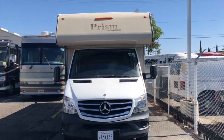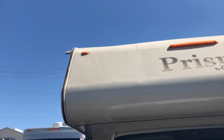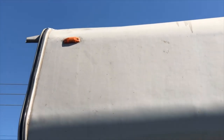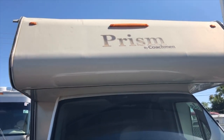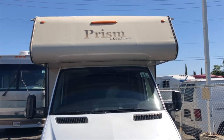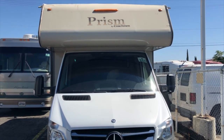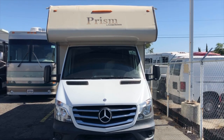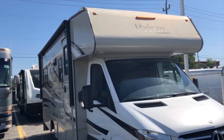Now let me show you an outside view. On the front cap, we've discovered some wrinkling — customers will often see a distortion, wrinkles, or marks where it comes loose. At first they thought water was getting inside, but we recently did a roof reseal and body reseal so that wouldn't have caused it. We wanted to show them that there's no insulation. This is pretty typical — if you look at our past videos and pictures, a lot of units don't have insulation up top, whether it fell down or the manufacturer simply didn't install it.